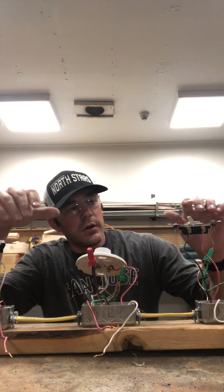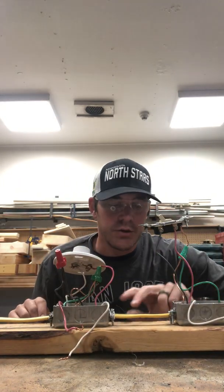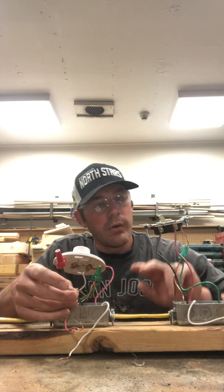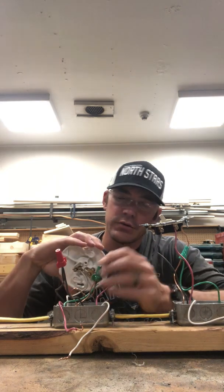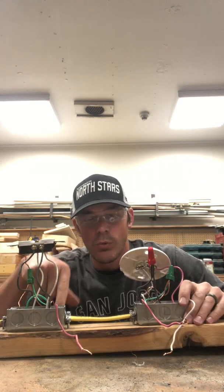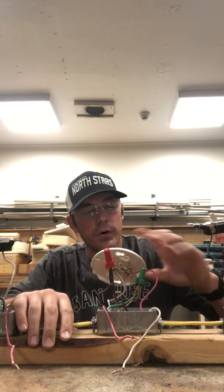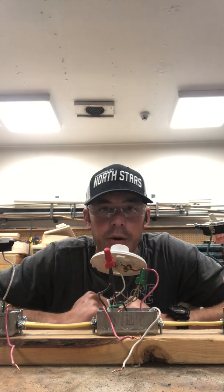So electrical current will go from box 1 to box 3. We're going to utilize our 12-3 cable by having our black wire used all the way over to our light switch in box number 3. The red wire will relay back over to our lamp holder with the same red wire. The red wire between boxes 1 and 2 will not be used. It's not necessary. And of course, we'll then have our neutrals relayed all the way back over to our power in box number 1.